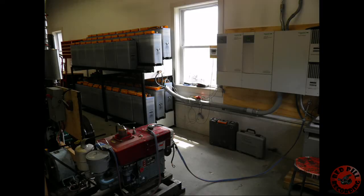And my solar that you saw on the wall, my thermal solar, I call it, I need electricity for that because I have to keep circulating the glycol through there. Otherwise, it's going to all boil out. So that is all run by electric. It's not a lot, but I need some electric. Okay, well, let's hit the next one.